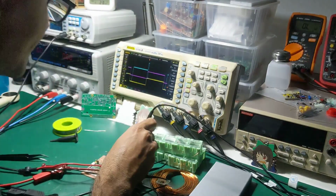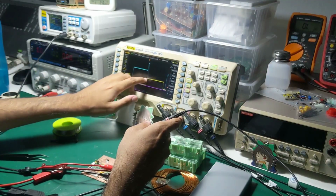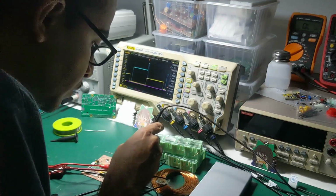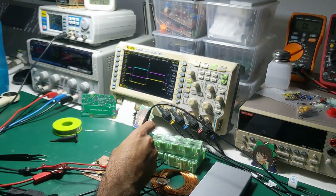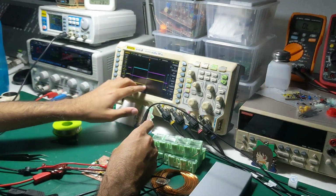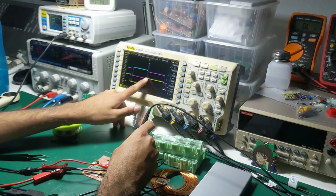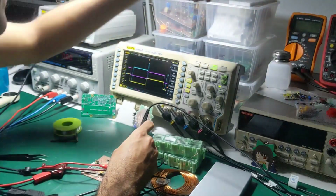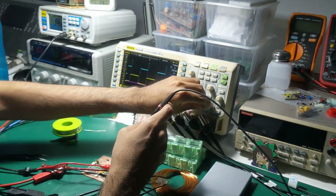It's still doing the level shifting thing on the base. So this is the input signal, it's 10 volts peak to peak. Of course, it doesn't go negative. Wait, if you look at the emitter, you're telling me you have a negative signal generator. I literally said I don't have negative just now. Oh. So the yellow trace is the function generator, so it goes from 0 to 10. That's why I said 10 volts peak to peak. But yeah, that was misleading. My bad. And the blue waveform is the output.